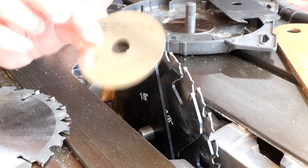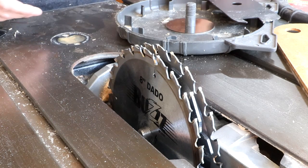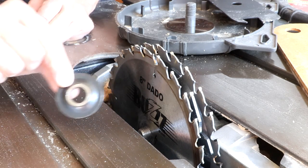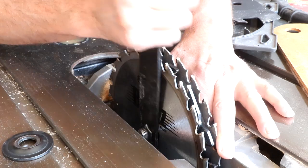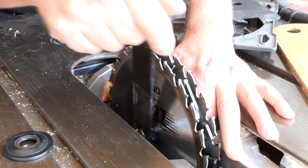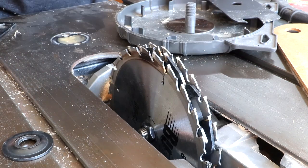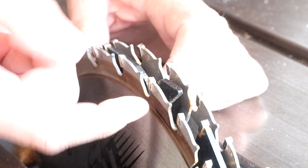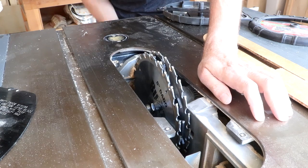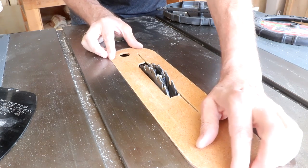With the chippers in place, put on the necessary thick shim and then the second full-size blade. The washer may not fit on with so many blades — that's okay, just put the nut back on the arbor. When tightening down any saw blade on a table saw, don't over-tighten it; just tighten until it stops or it can be very difficult to remove. Give everything a once-over to make sure no teeth are grinding together and all teeth face the right direction. You never want to operate a table saw without the throat plate in place.